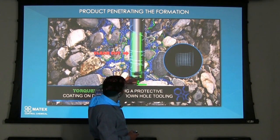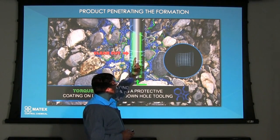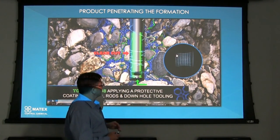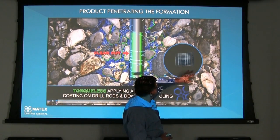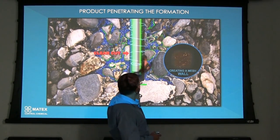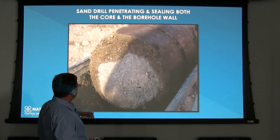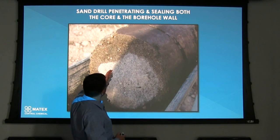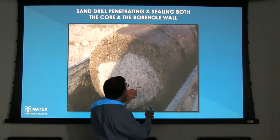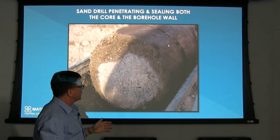The blue demonstrates the Sand Drill and the green demonstrates the Torqueless. The Torqueless is coating all of your drill steel — it's also coating your drill bit, not allowing anything to stick to it. On the inside as it comes down, it's coating everything all the way down including your tube, allowing the core to slide up inside the tube which has already been wrapped in Sand Drill. As we're drilling, we're introducing the product, creating this mesh, and any voids are packed in with cuttings and this mesh to make a nice solid hole — just like the inside of a gun barrel.